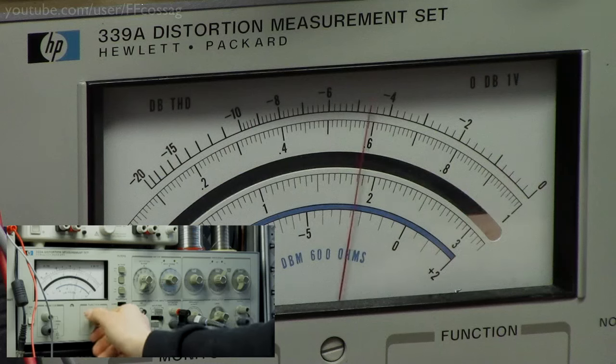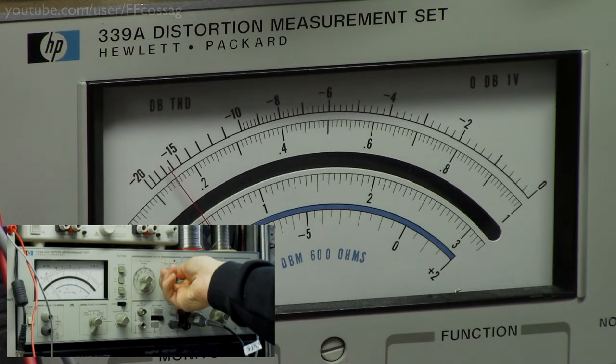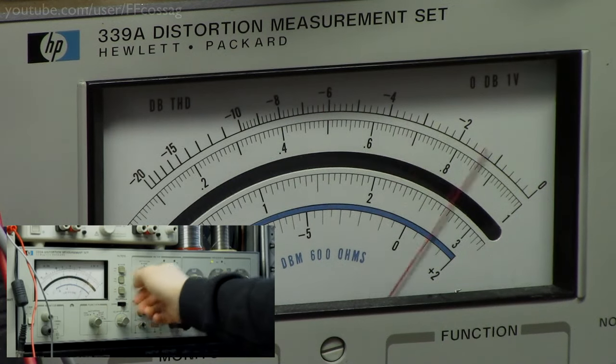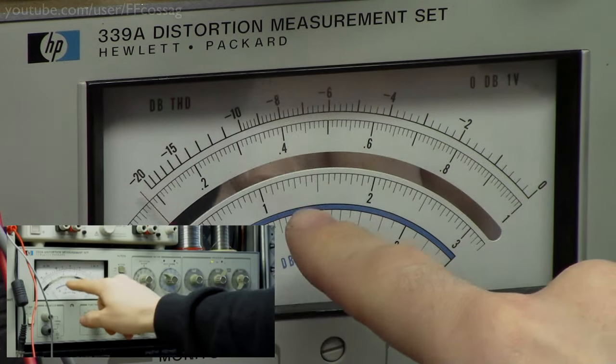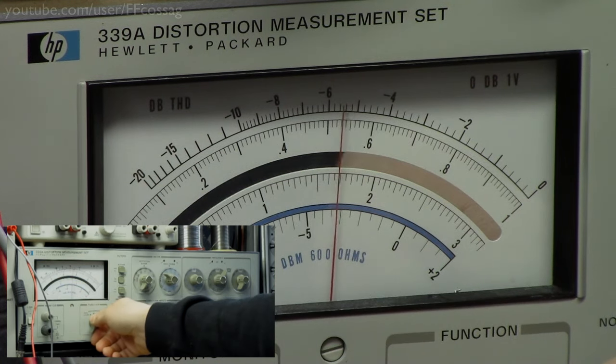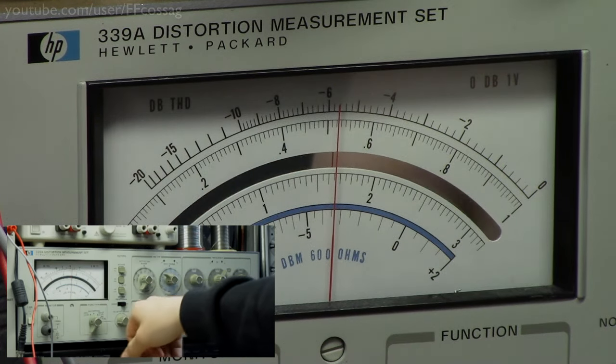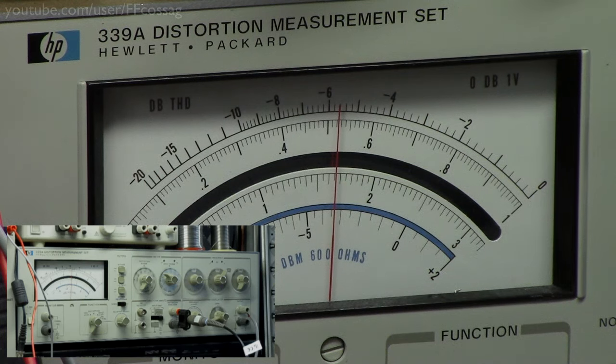Anyway, let's just see what kind of power output we can get. So, 30 volt full scale, let's just turn it up. We're at the 24 volt supply, so it's probably going to do about 15 volts, same as we always do. 3% distortion full scale, so let's check at 1%, there will be slight clipping. And we're at 16.5 volts into 8 ohms, so that would be just about 35 watts. That's not too bad, we're getting a bit more power than out of a standard stereo configured TPA3116.